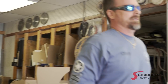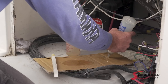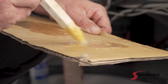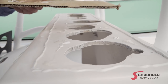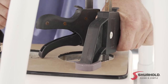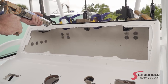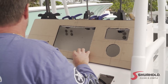After that we went outside to the boat and started to prep it for epoxy and gluing it down, because we want the effect of no screws. We mixed up a two-part epoxy and used a combination of 5200 and a lot of clamps — I can't stress that enough. We use the epoxy because it's fast set, and the 5200 does take a little longer to cure. Over time the epoxy becomes less relevant because it can crack away if the boat's flexing a lot, but the 5200 will not — it'll keep its properties and hold that panel on there while allowing a little movement.